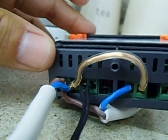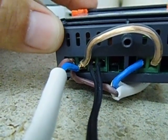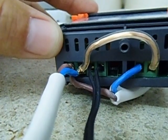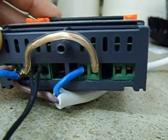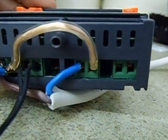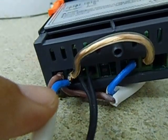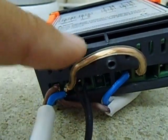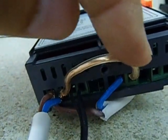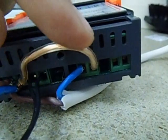Next to the brown wire is the blue wire, which goes to power supply number two, and that goes to the plug as well. Then power supply number two will run to number six of the heating relay — that little copper wire there. Number one is the positive, number two is the negative, which is the blue wire. That's connected onto this insulated copper wire that runs to number six on the heating relay.